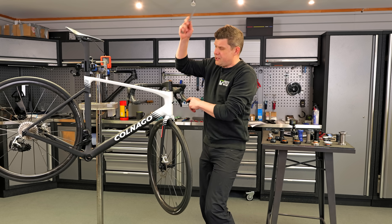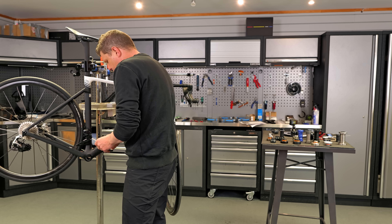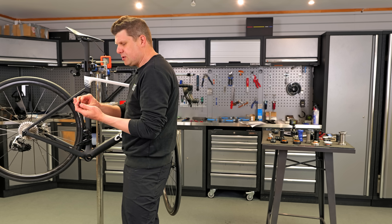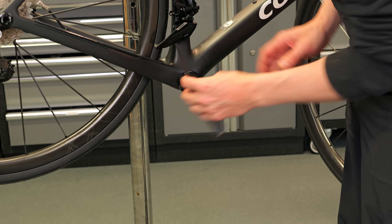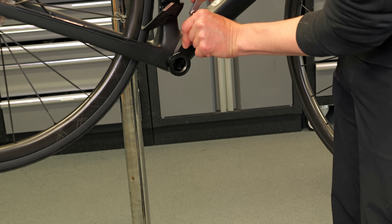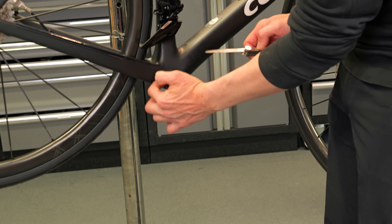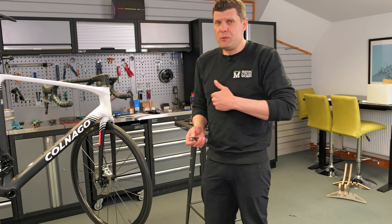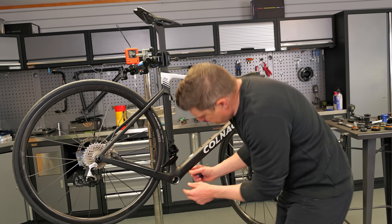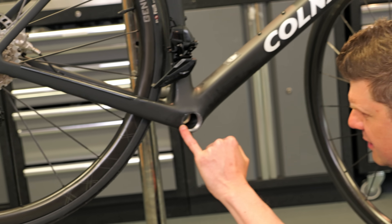While this is in here, I can take my feeler gauges and get a better idea of where our gaps are. I had this set to 0.4mm. We are tight here, but coming up here I've got a big gap — big gaps all the way around here. We are tight on this edge on this side. I think in that original video, I didn't actually remove enough material, and I can see I've still left a blob of paint just here.